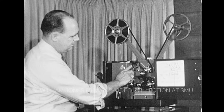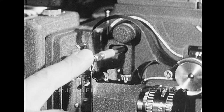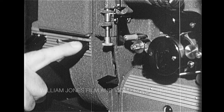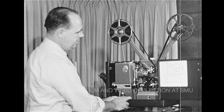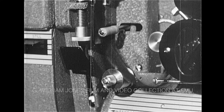On occasion, you may want to stop the movie on a particular frame. First, stop the projector by releasing the top safety film trip. Next, depress the still picture lever. Then turn the hand operating lever slightly to get the full picture. To resume the showing, release the still picture lever and raise the operating lever. You may also want to reverse the film — simply depress the rear tension roller.